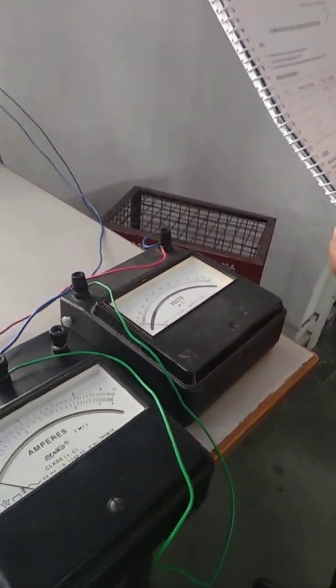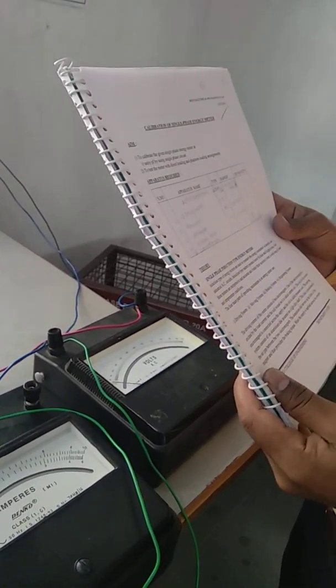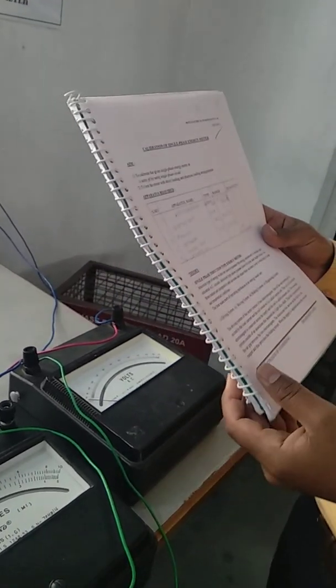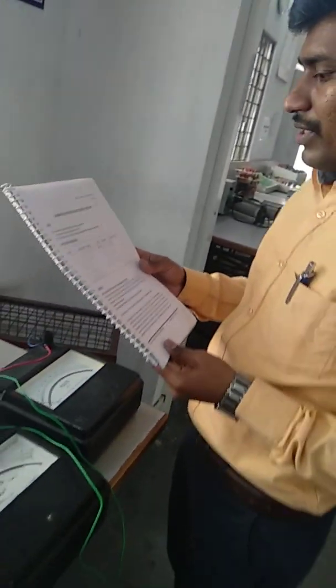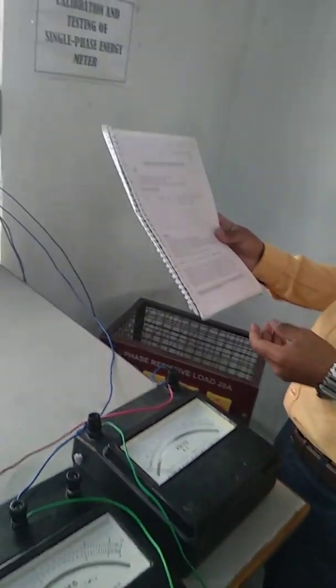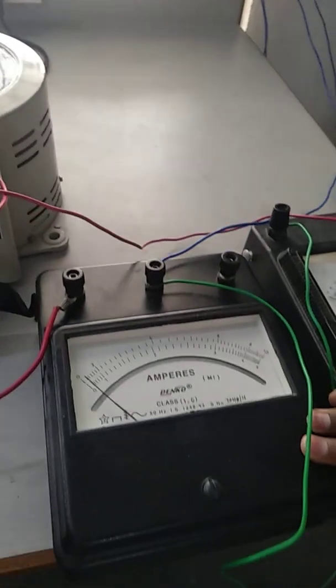If you see the calibration — what do you mean by calibration? Calibration is nothing but finding the error by comparing the reading of the actual meter, taking the consideration of other meters which are going to be used to measure the actual value. In this experiment, we are going to see the calibration of energy meter by taking the comparison of voltmeter and ammeter readings.